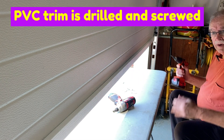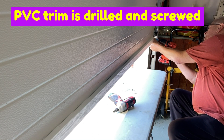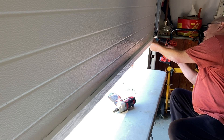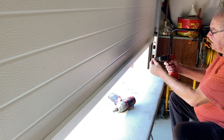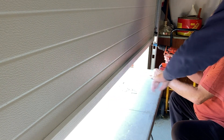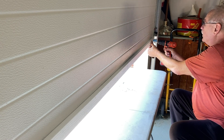That's basically going to be the new bottom edge of our door. We're going to pre-drill the PVC but not go all the way through, because I don't want to drill into the metal. The screws I've got are some self-tapping screws and those will drill through the aluminum really easy and also through the rest of the PVC to break through to the aluminum. The drill is slightly smaller than the screw, so it's actually going to thread into the PVC, but it shouldn't be too tight. So we're going to go ahead and mark a number of places where we want to drill the holes and put the screws in. I'll start at one inch and go about every nine inches.